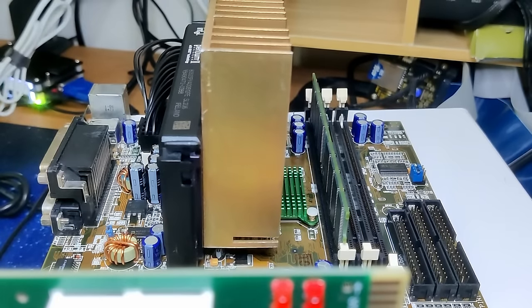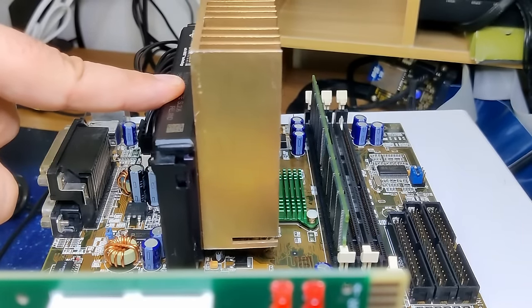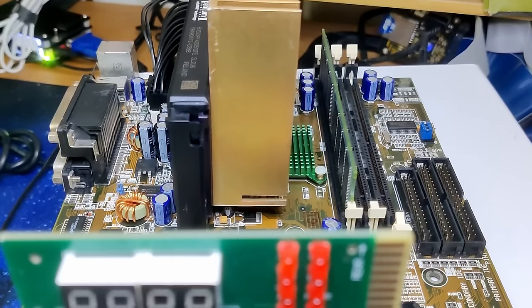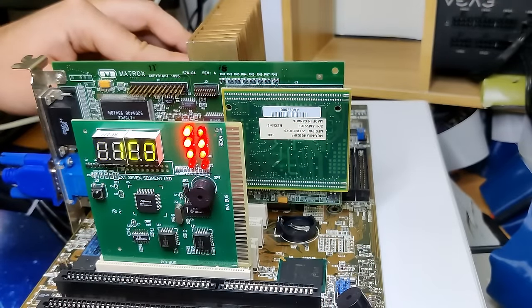During the second power cycle, I had a feeling that the oversized and heavy heatsink on this Pentium 2 may be responsible for the poor contact. The CPU tilts to one side and thus may prevent the Pentium from properly connecting to the socket. But as we all know, the third time's a charm. This time, however, I will push the Pentium firmly to the left.